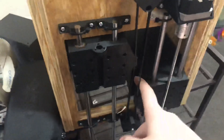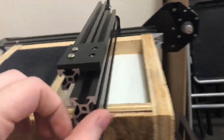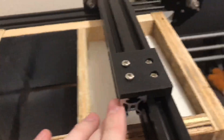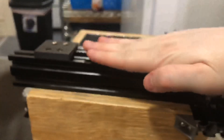I've got all the plastic parts mounted with the exception of one part I still need to print. I've mounted the actual wiper mechanism and leveled it out. There's a small offset here, so I printed out this L-shaped block that mounts to it and used some hammer nuts and screws for that. Then to actually level it, another L-bracket I printed has a screw and nut on the top side that attaches to the T-slot, and this screw-nut just pushes into the wood here, making the whole thing pivot up and down so I can adjust if it's tilted in any way.